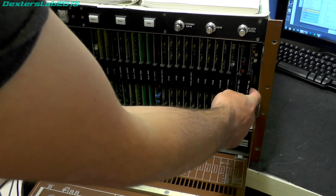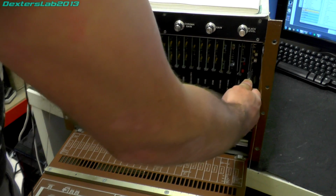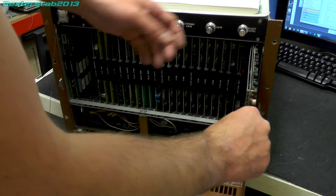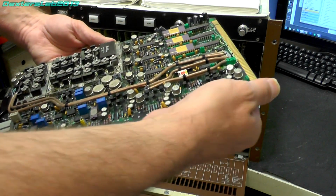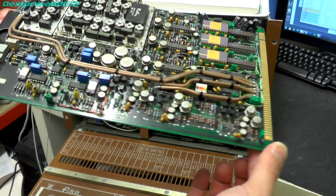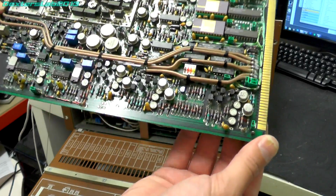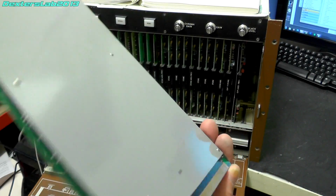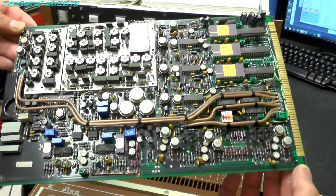And the next card along is the output processor card and has PAL written on it, so I think we can guess that this one is going to take the digital video and convert it into PAL analog video. And yeah, it's all very analog. Really nice looking board though. We've got a number of hard coax cables running over to the back, which presumably then run out to the back panel. We've got another shielding plate on the back, and yeah, it's definitely looking very old school, that one.